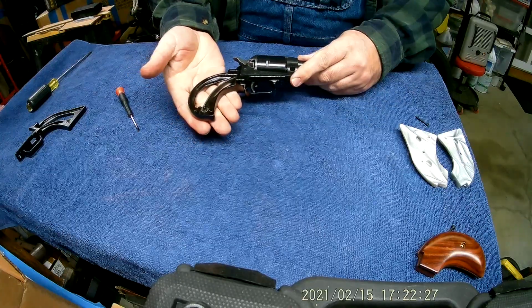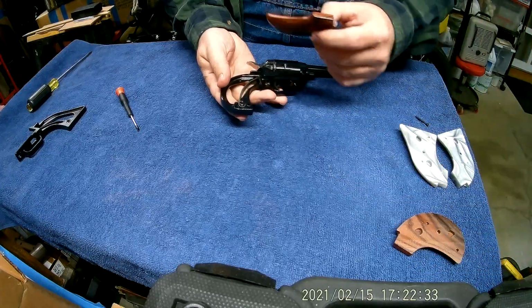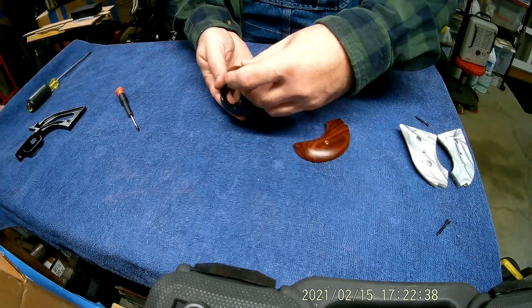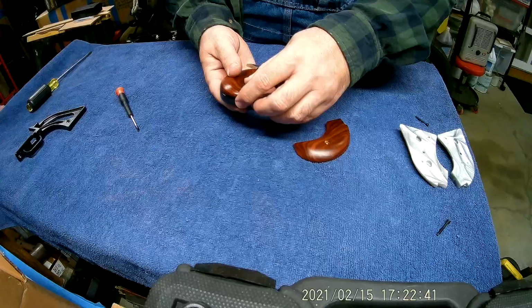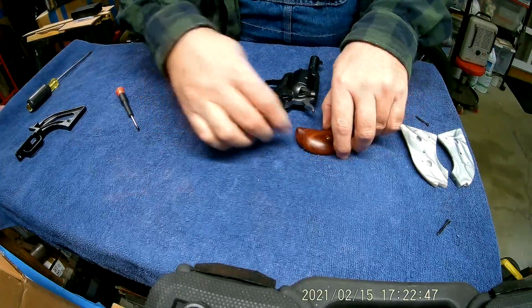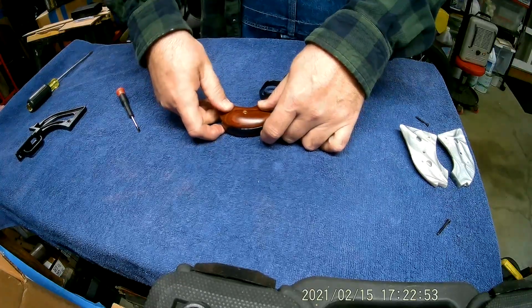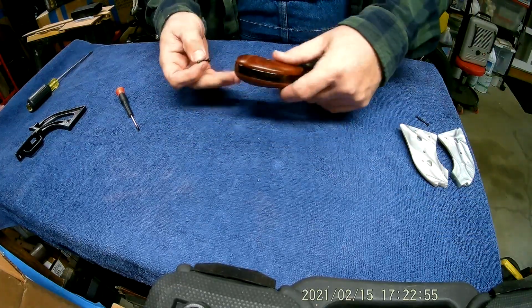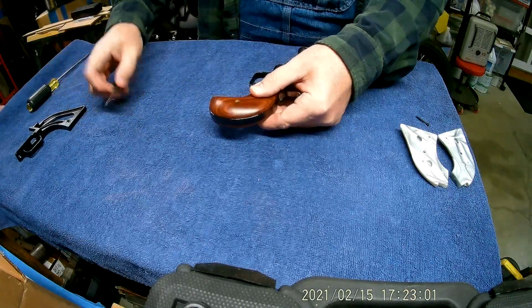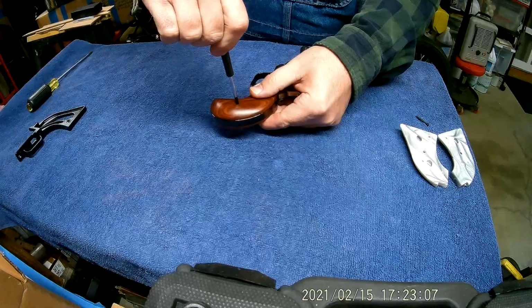And there's the frame. This Birdshead frame also has the little nubbin, and you can get your choice of grip panels. This one shows the Cocobolo. And you're going to want to make sure that that little pin goes into the small hole in the grip panels. And press these just a little bit. One side of the grip has the threaded hole, one has the open hole that the screw goes into. Just drop it in. Don't over tighten it.